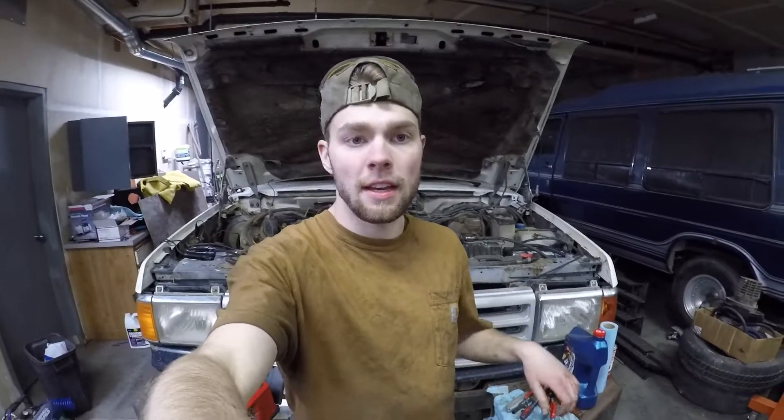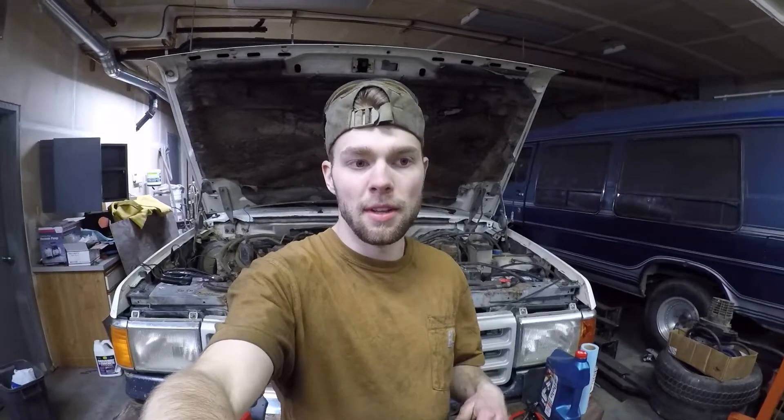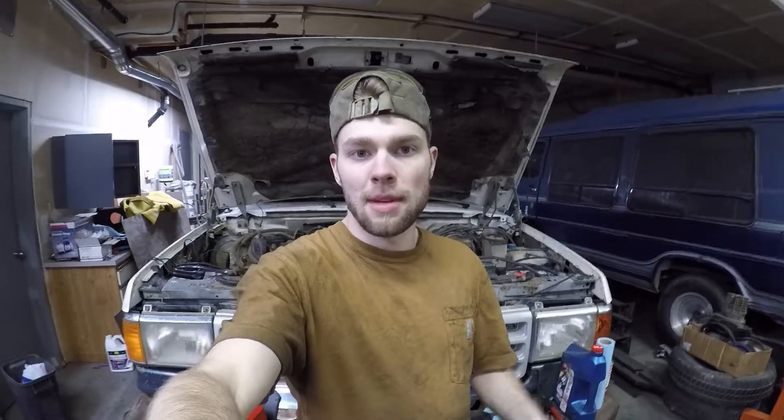I had great air-free pressure at the filter head but I just couldn't get the thing to start — cranking and cranking and it absolutely would not start. I'd get all my lines nicely purged and then come back 15 minutes later and they all had air in them again. So what I ended up doing was just throwing some new fuel line at the return lines. I still needed to do a full kit, but I wanted to find out if that was the problem — and it fired up immediately after replacing all the bad return lines.